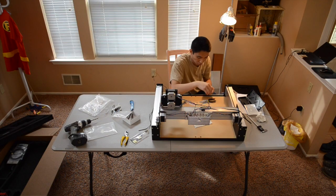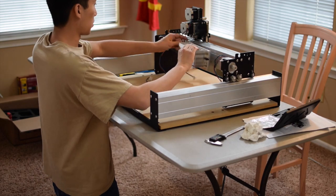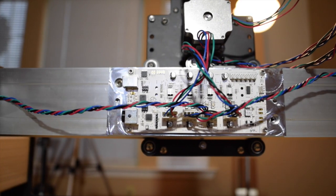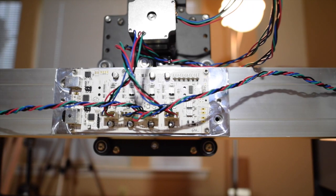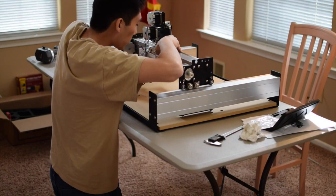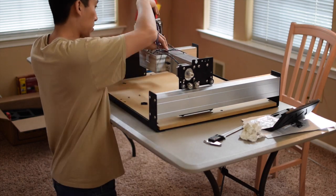Once your structure is complete, you can install the GT2 belts and anchors as well as your motor control board. Your motor control board comes with a cooling fan which is 100% optional. The board is mounted in such a way that it basically uses the entire X-axis rail as a heatsink — more than enough thermal mass to let you run the motors at full current without active cooling, but the fan is included anyway for your peace of mind. Another big improvement is that you can plug your motors directly into the control board. Say goodbye to those awkward terminal blocks you used on the Shapeoko 2.